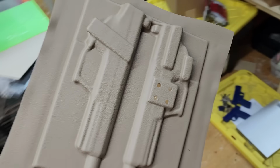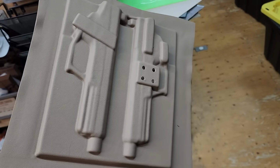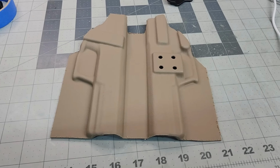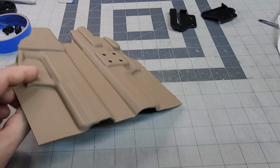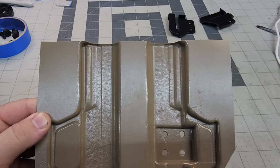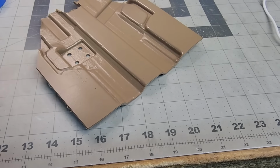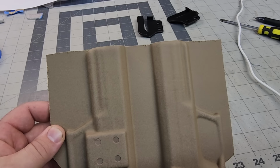All right, we are drilled. Now I'm just going to go to the bandsaw and we're going to go ahead and just cut out the outer circumference and fold it so we can do our final cut down to that shape. Now when I do cuts for compensators, I like to do it when it's in this stage before folded. Obviously, if it's a foam press, we can't do that, but it is a lot easier, in my opinion, to cut it like this and then hit it flat. But like I said, you could also do it while it's folded, but you have the chance of cutting it crooked, and then you have to spend more time on the belt sander.